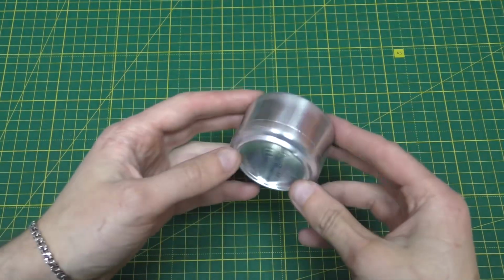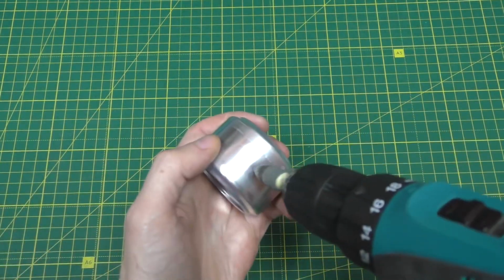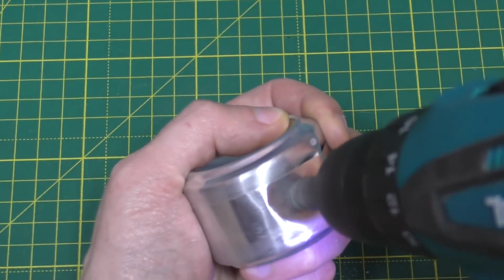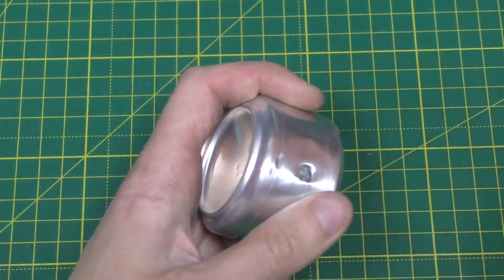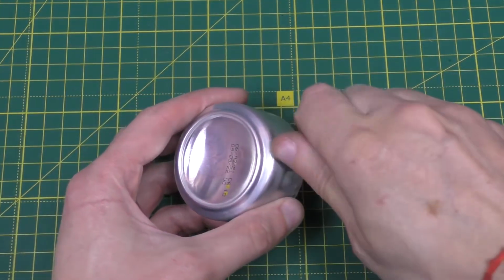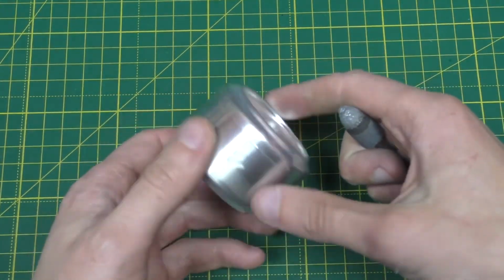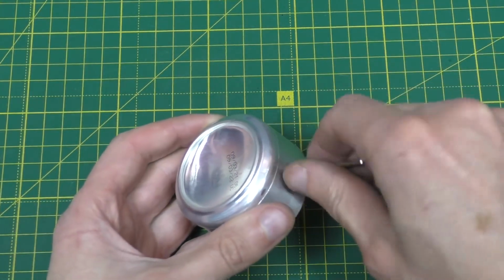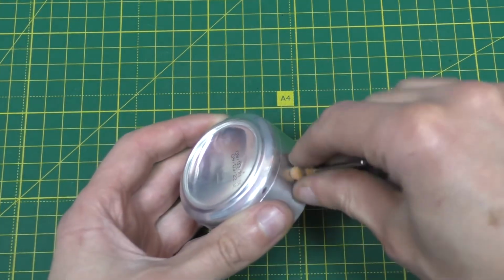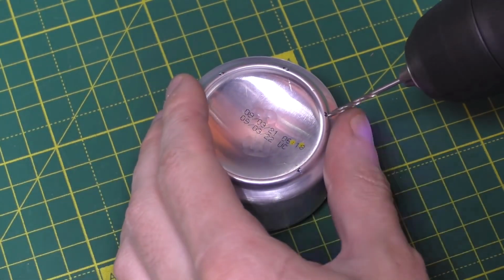You need to make 2 holes in this thing, one at 0.39 inches and the other at 0.236 inches. A drill won't make a precise hole, use a grinding stone instead. Drill several 0.0787 inches holes in the upper part.